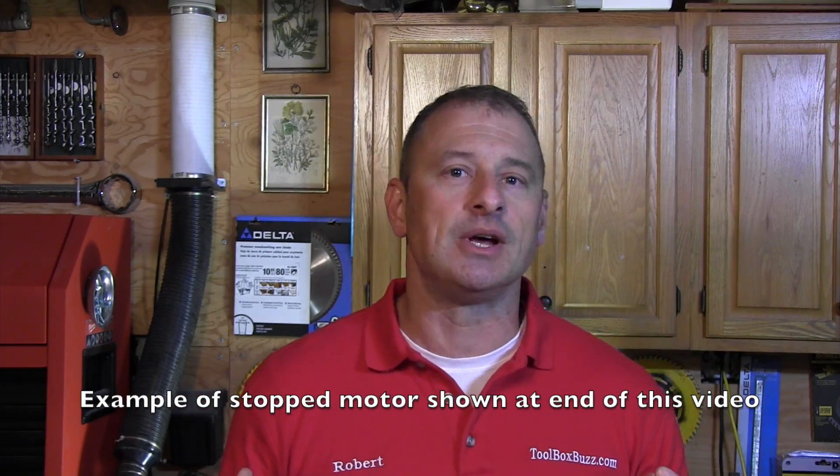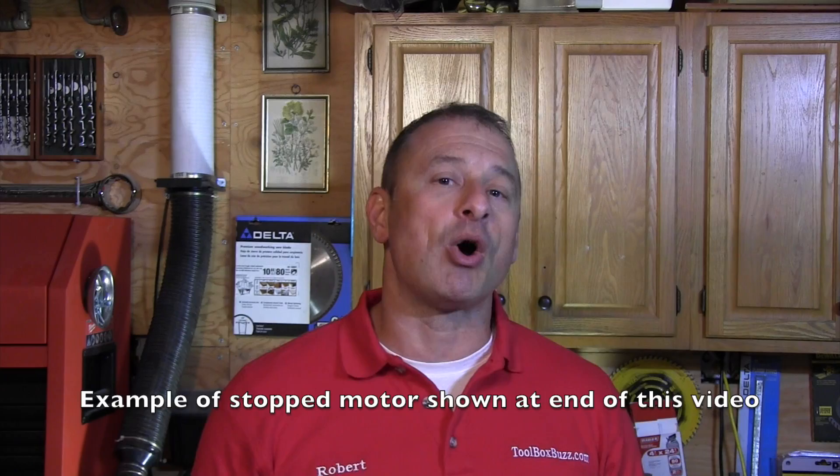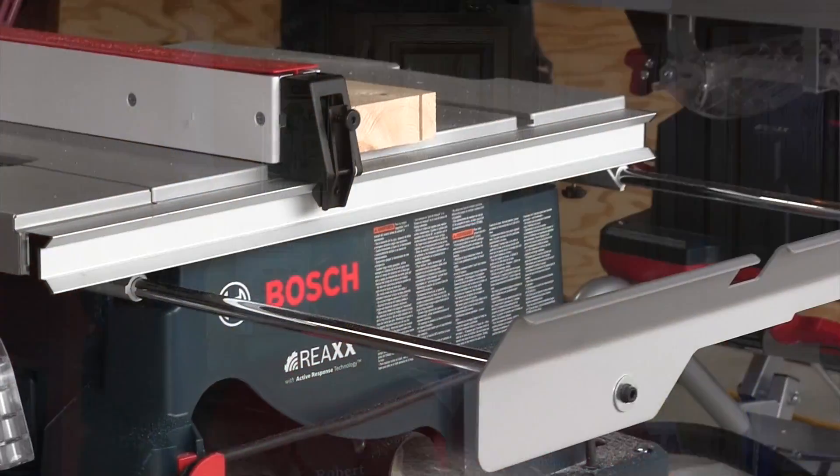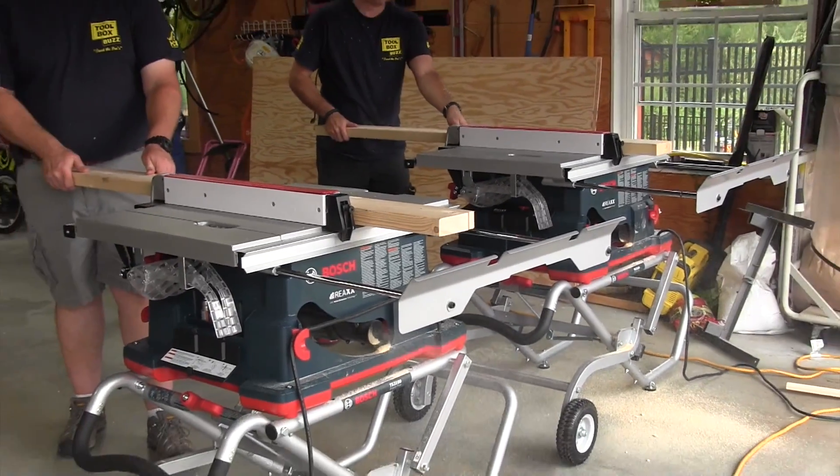If the feed rate is too fast, the blade and motor completely stop with just a humming sound — that happened to me earlier today. You have to turn the switch off and back on to reset the saw. We tried three different manufacturer blades, used 25-foot and 50-foot 12-gauge extension cords, and plugged directly into 15-amp and 20-amp outlets. We used two different REACT saws. When plugged directly into the outlet the saw was slightly better, but still underpowered.